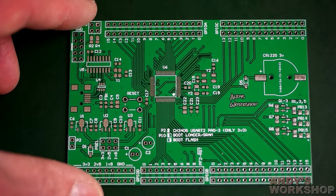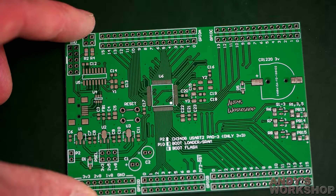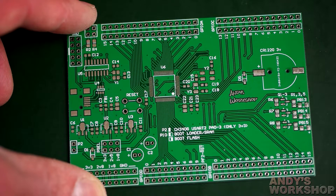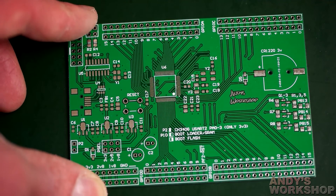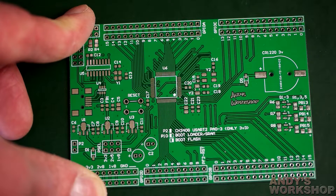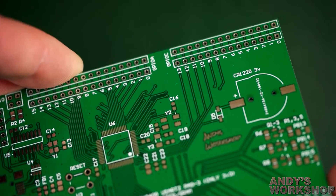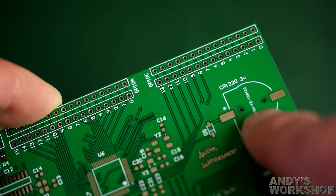The design house obviously has so much confidence in their solder mask positioning accuracy that they've ignored the expansion rules I sent and put the mask as close to the pads as they possibly can. That means I'm going to be able to build this board with confidence. Looking at some other details — it looks like the holes used to steady the battery holder from slipping are non-plated.